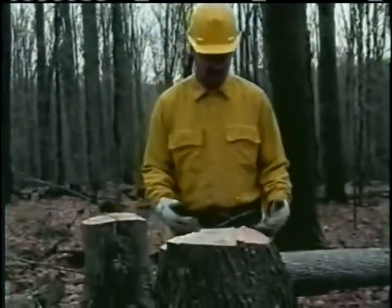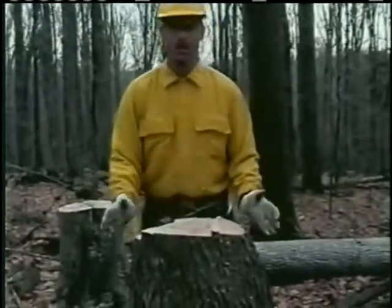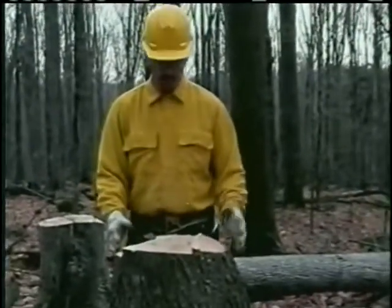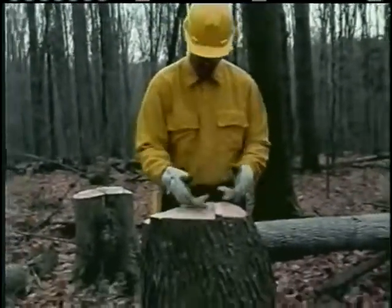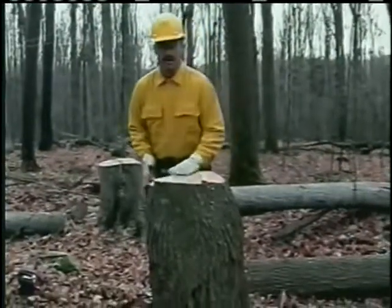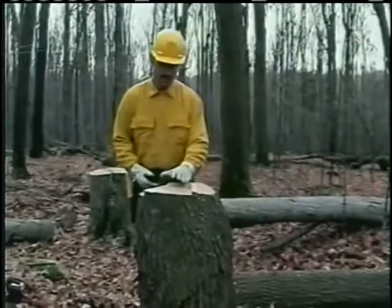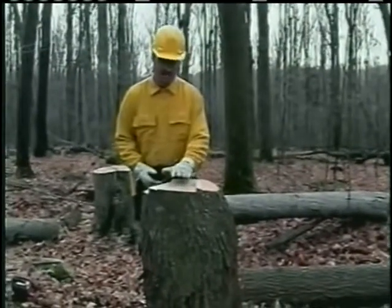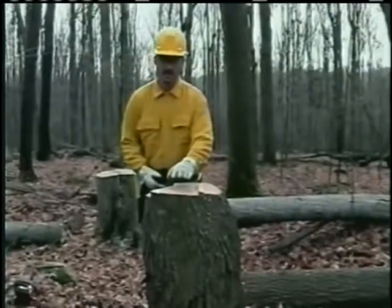After falling a tree, we should come back and look at our stump and evaluate how well we did to our established plan. We wanted the 12-inch hinge, which we already checked. We wanted 1.25 inch hinge, which we've established, and our back cut is level. With an open face notch, I can create my back cut at the point where the notch cuts meet, above, or even below.